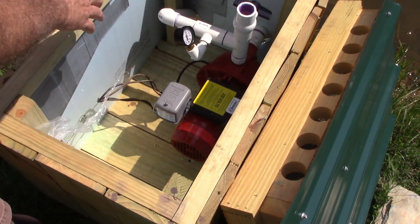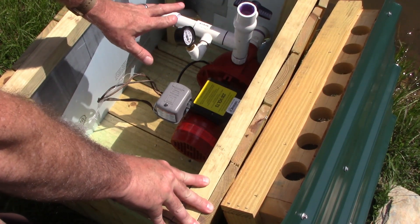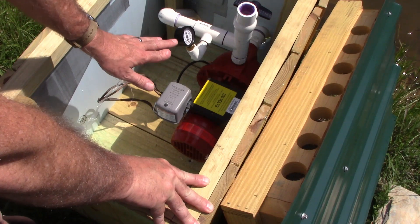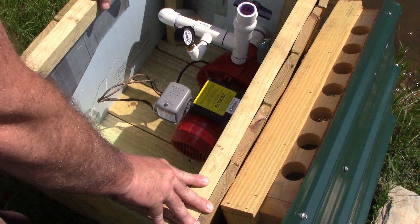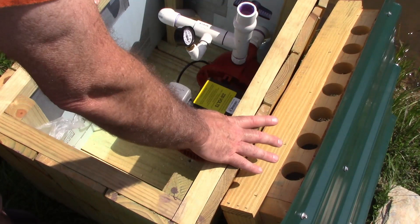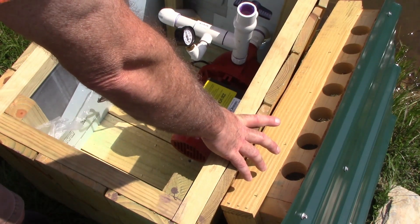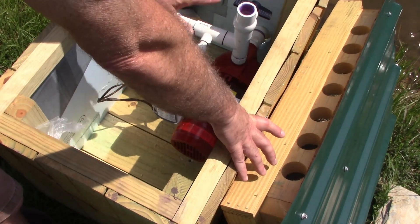The reason I had to change out this pump was the pump I had was high volume — it would put out a lot of water but only at about 45 PSI. The problem is my house sits up on a mountain, probably 50 feet vertically up, and it wasn't producing enough pressure by the time it got to the house — it could hardly run a sprinkler. This new one puts out less volume but about 78 or 80 PSI. I'll link this pump in the description along with this pump controller in case you're interested.